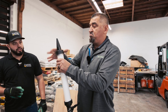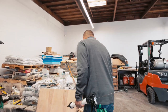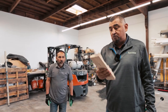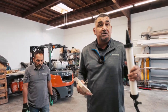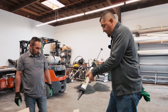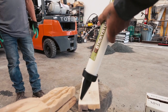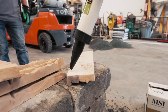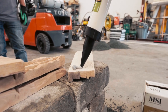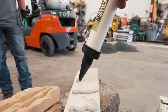You don't even need more than the metal fitting — that's it, no mixer required. Now I'm ready to go. For veneer application, you're going to put vertical beads about every three to four inches apart. Pump it out and apply a vertical bead — one, two, three.